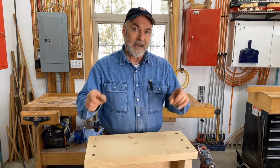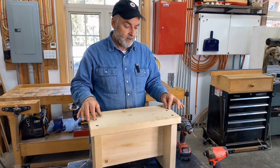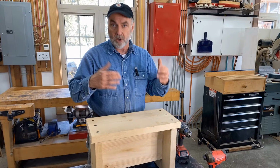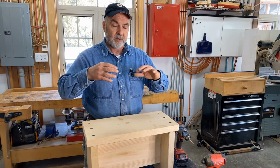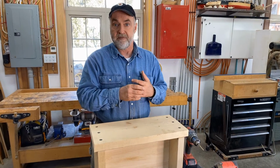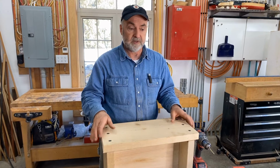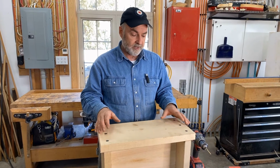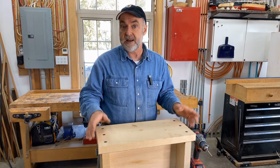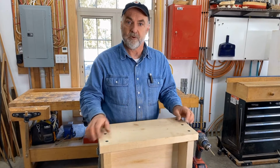So now I need to go over to a truly flat surface so we can make sure that we're getting rid of the wobble in the stool and we're not compensating for any kind of a twisted floor. So you'll have to find what you believe to be a flat surface. That could be, I don't know, a kitchen counter. It could be a floor if it's flat. It could be different things, but right now I'm going to go over to my table saw, which is the flattest, handiest surface I have in my workshop right now, and we're going to do the scribing over there.